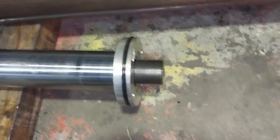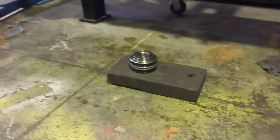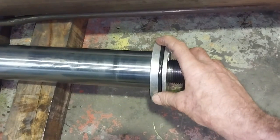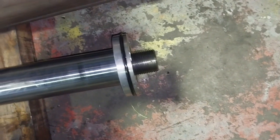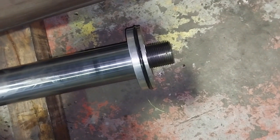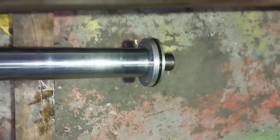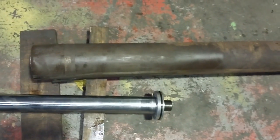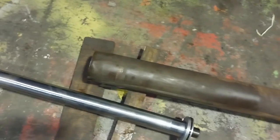It worked really well — we slid it in, started rotating the other end, and it engaged and screwed all the way onto the piston. Then we pulled the spacer, piston, and the original piston out of the bore. So if you pull a rod out and the thread isn't damaged — it looks awesome and in great condition — there's a good chance you can use this method to support the rod, screw it back into the piston, and pull it out. And that's just what happened; it came out looking pretty awesome.